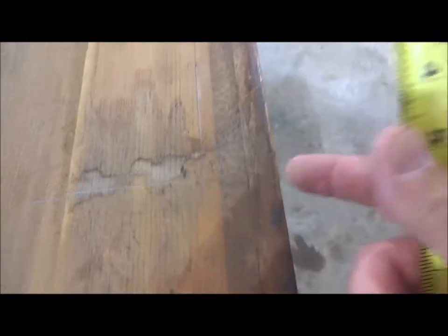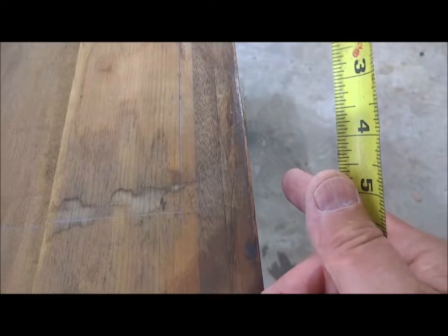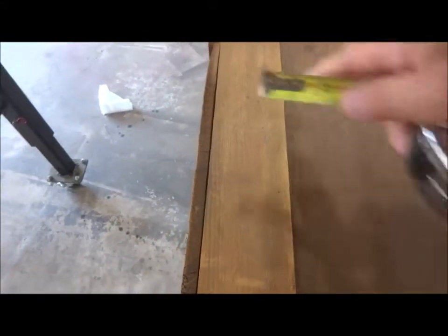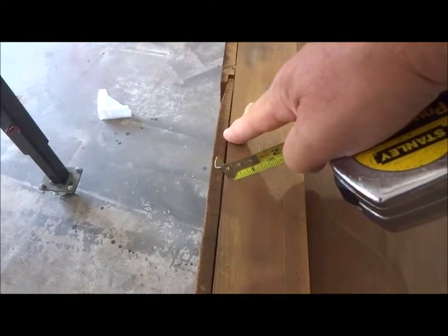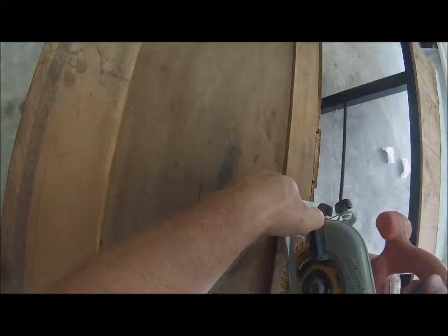So we go over here, and we've kind of laid it out. I think what I'm going to do is cheat up here. You can see a line right here. I've already got it drawn in there. We're going to cut a hole 15 inches. That's going to give me a little bit of meat here. The edge of the counter will stick out another about 3/4 of an inch, so it'll stick out to about here, which should be all right. I'll deal with the plumbing holes later, because I think they're going to come out right about in here. Once I get it on there, I'll figure out how I'm going to deal with that. So what we're ready to do now is go ahead and cut this hole.